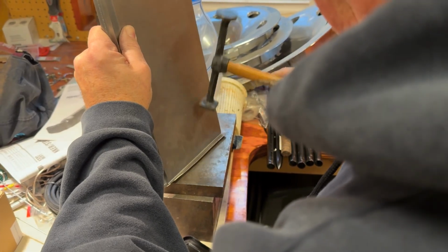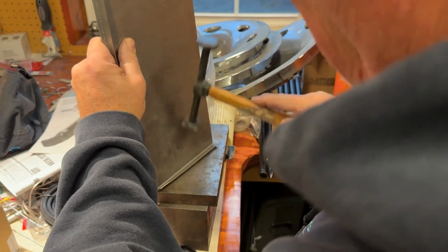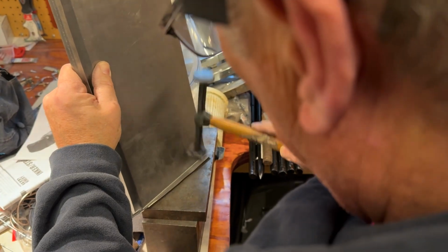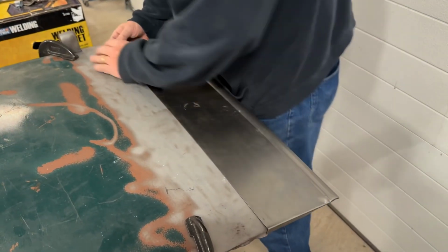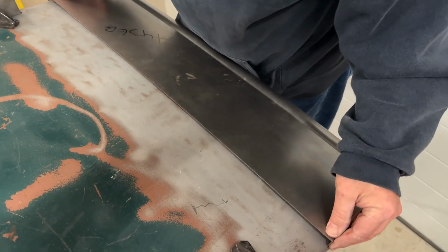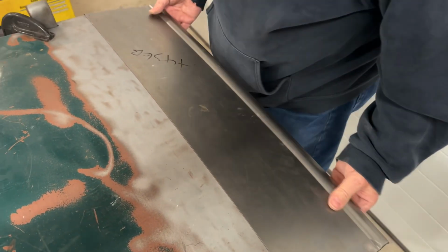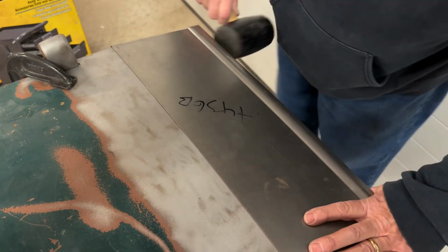Opening up the two outside edges of the replacement panel with our body hammer and anvil will allow us the flexibility we need to push our new panel up to the exact spot that we'll want to mark and make our final cut. A 1930 two-door has doors that measure 44 inches tall. We want ours to clock in as close to that number as possible, so having precise measurements is important.